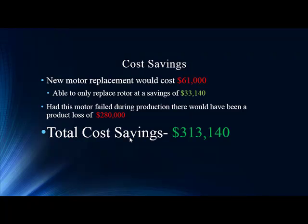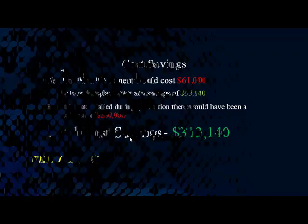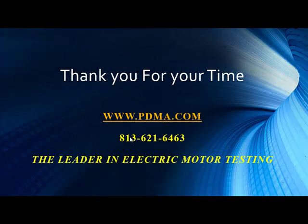With this new rotor going in and all the stops and starts on this asset, they're talking about putting a variable frequency drive on it to lessen the blows of the starts and stops. It's a very good idea, especially in applications requiring this many starts and stops. A VFD will allow reduced torque on startup and can reduce the motor frequency to reduce airflow rather than shutting the entire motor down — slowing down rather than stopping.